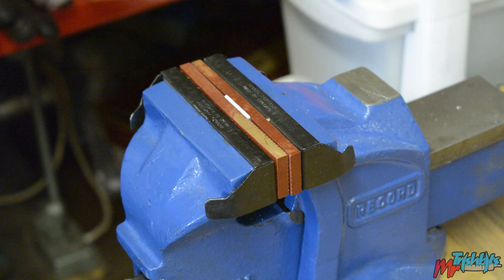As you can imagine at this point, I wasn't impressed with myself. It's 6082 — I should have heated it up to let it bend. Instead, like a fool, I thought I'd just bend it; it didn't seem too hard or difficult. It was. It broke.